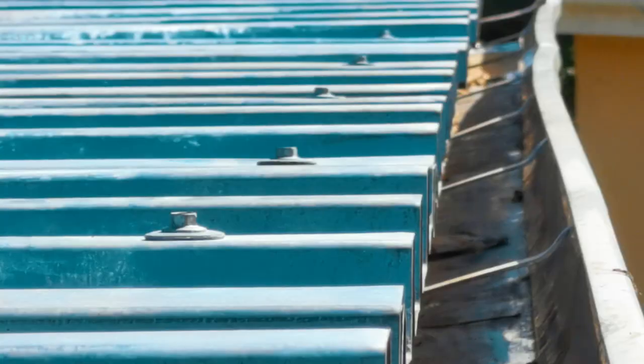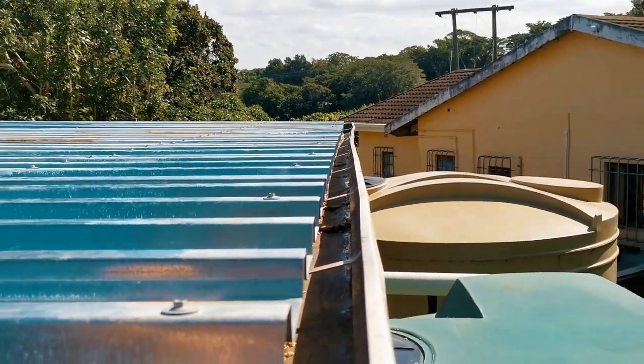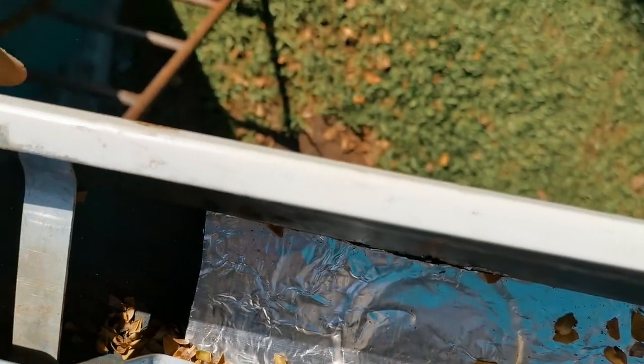The one half of the tile roof structure has got the gutter that directs the water straight onto these corrugated sheetings — the IBR — which then directs it down into the bottom gutters. We moved this gutter on this side to the end over there so that we could end up recycling it instead of having to buy a new one. It just took a bit of tinkering and patchwork on the old downpipes.